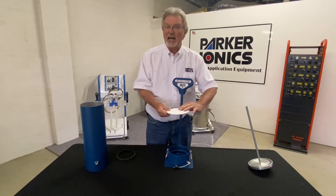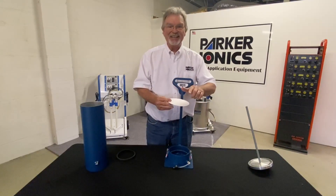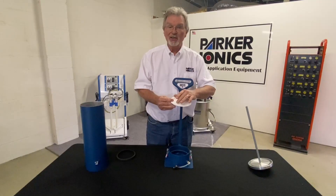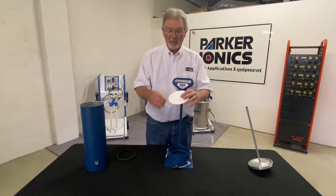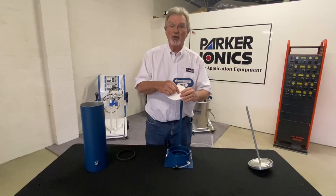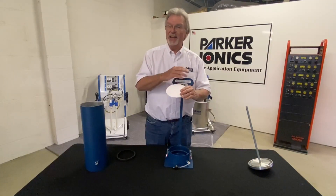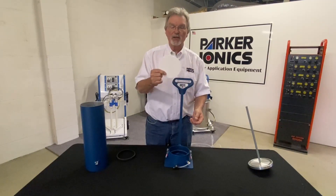The fluid tile is a replaceable part. If you see staining from powder on the top side, no worries. But if you look on the bottom side and see any staining — gray or a rusty color — that's bad. It means you've got oil or water in your compressed air, and those contaminants block up the millions of pores. Once water or oil goes into those small holes they never come out, so at that point you need to replace your fluid tile.